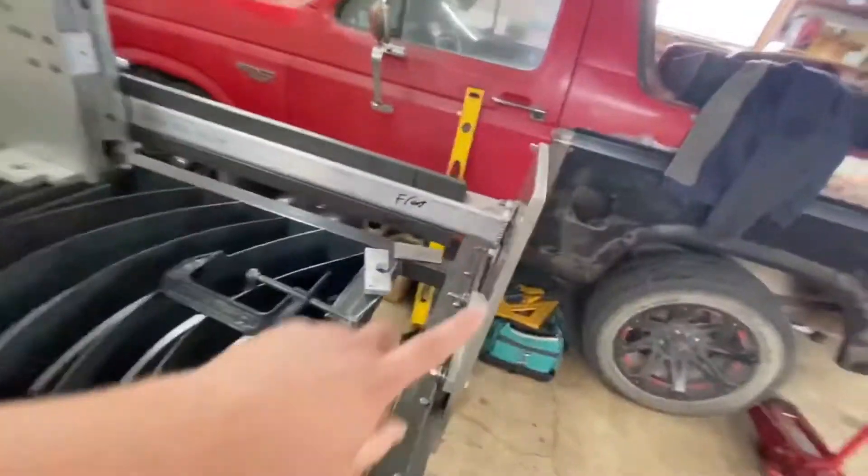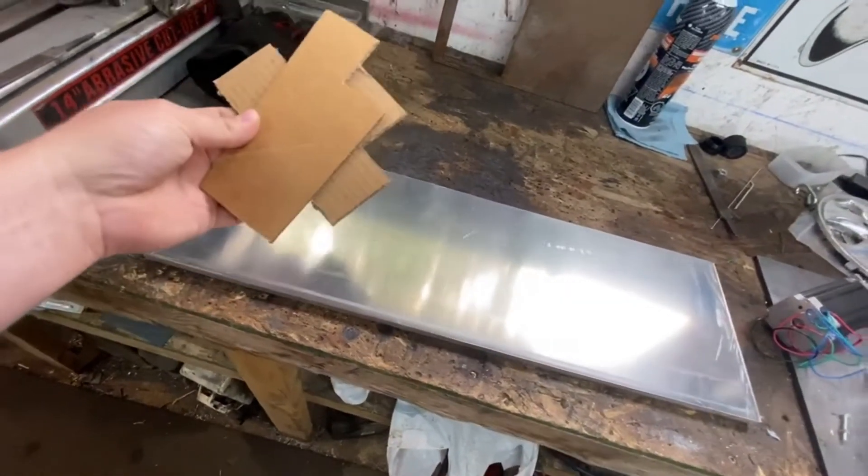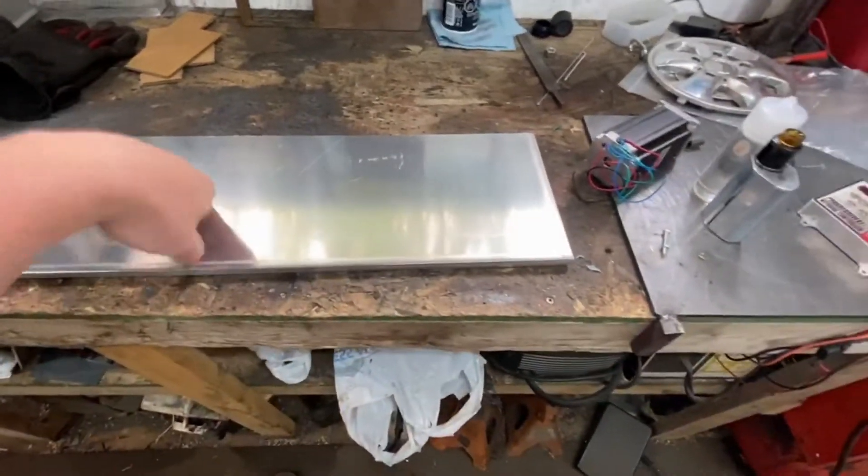It kind of sucks I have to use steel — I didn't really want to add too much weight to the gantry, hence why I built it out of aluminum in the first place, so the motors don't have to work harder. But what I'm adding really isn't that much weight, and once you start looking at all the half inch aluminum I already have on this thing, the lightweight idea kind of left the building. But I like to think I'm trying. So I'm going to cut some of those pieces. In the next upcoming video I've already been looking at some templates for the back motor, but we'll get to that later. For right now I'm going to make those side plates that mount to the motor for adjustment, and hopefully find some hardware to mount the racks.